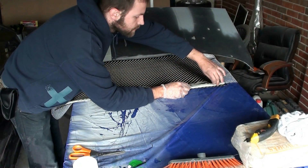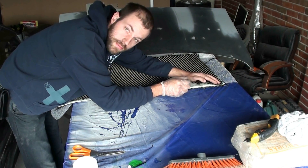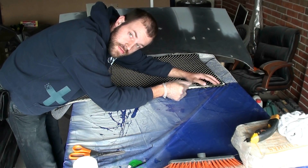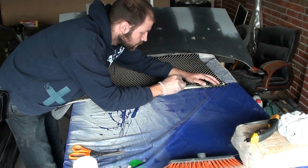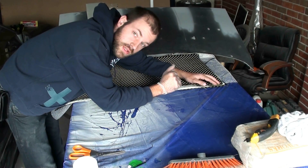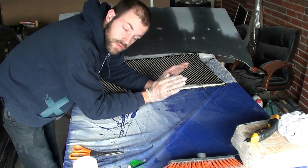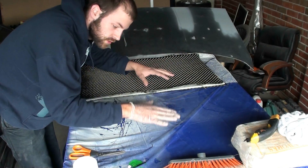As I've explained in the sandwich videos before, the carbon on top and bottom has very high tensile strength, and when something bends it's the top and bottom surfaces that do most of the stretching or compressing. So this should basically be unbendable. First I'm going to lay down the 200 grams per square meter sheet of carbon onto the mold by itself so I can do it really nicely and carefully, and then I'm going to place the rest carefully over the top.